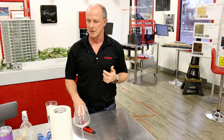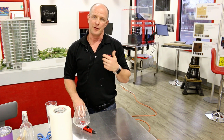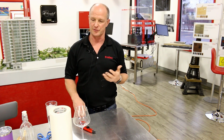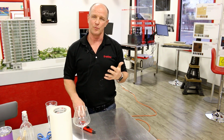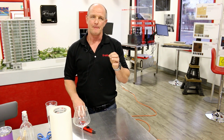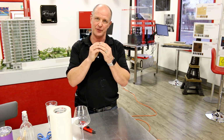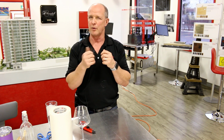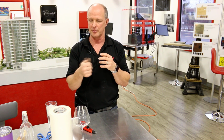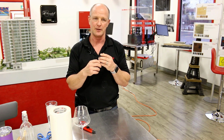And there's just a couple of things you've got to think about when you're doing glass. If you watch my video on doing photograph on glass, you'll notice that I use transfer tape. The problem when we just etch directly on glass with a laser machine is that the laser fractures the glass, you get really small fractures, and that's what gives us the contrast. And the problem is that when you laser etch bare glass, some of those fractures start to fall off. You'll get some sharding on the glass. You'll run your finger on it and you'll feel some shards of glass there.